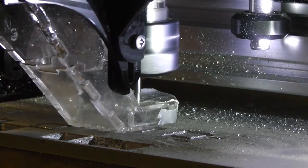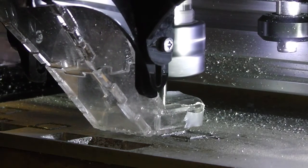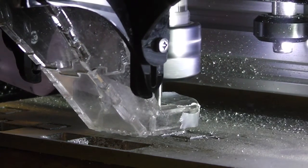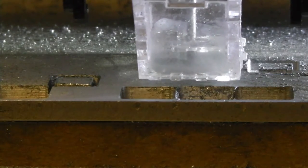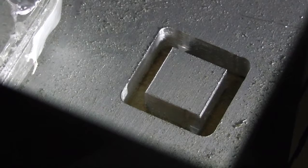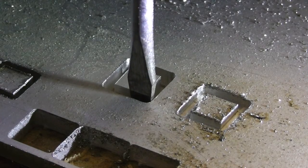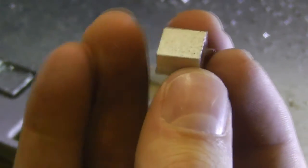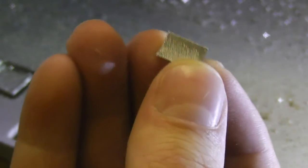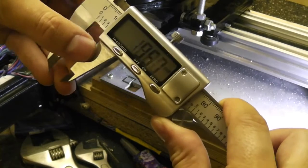You can still see there's quite a lot of aluminium escaping from the hole around the bits, so potentially I need to use duct tape to seal that a bit better. Overall though, keeping the extraction system so close to the surface of the aluminium is a huge improvement — you can see how clean the area around the cut is. I used a hammer and a screwdriver to break the tabs — there's got to be a better way, but those were the things I had handy. Again, that's a very nicely cut piece of aluminium in my opinion, and pretty much the same level of accuracy as before.